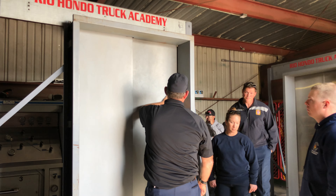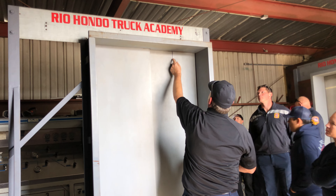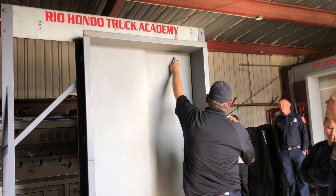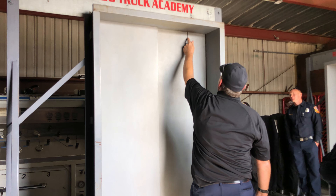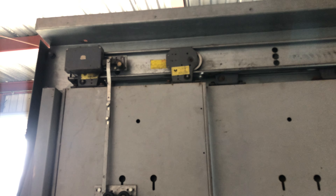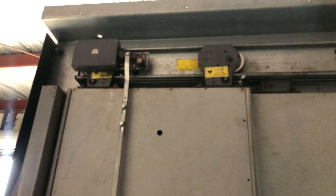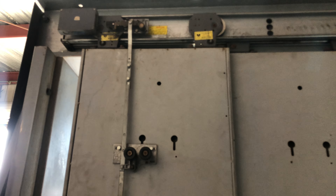One more time — do not let the doors slam. I go up in the center of the door. I turn it so it's resting on top. I come towards the opening. First thing I hit should be the locking arm — half an inch thick. I bump over it, come back on it. Index finger goes on the neck of the tool. I keep the tool pointed straight out but go from vertical to a 45°. Push straight up. Open the door. Close it up on your boot.